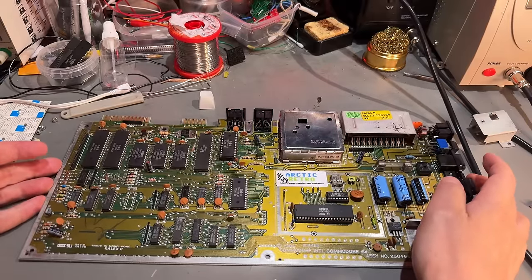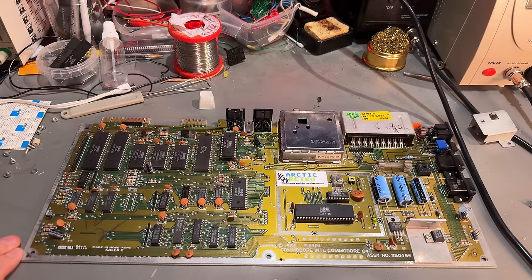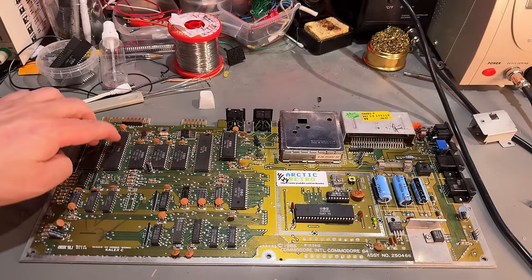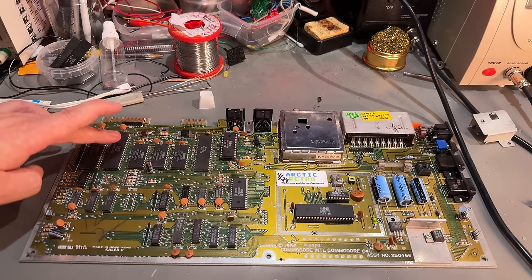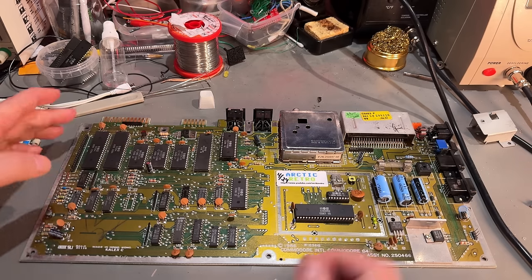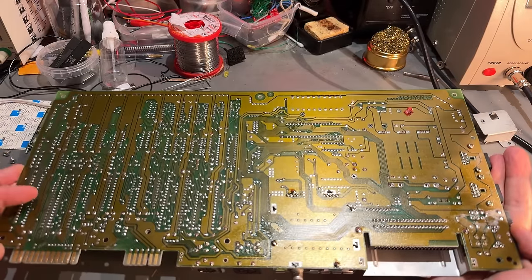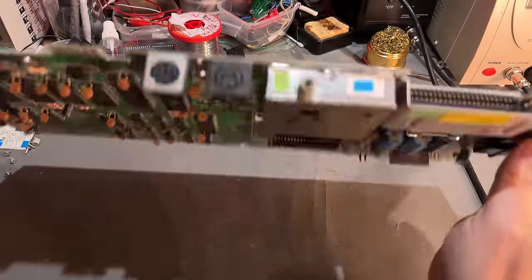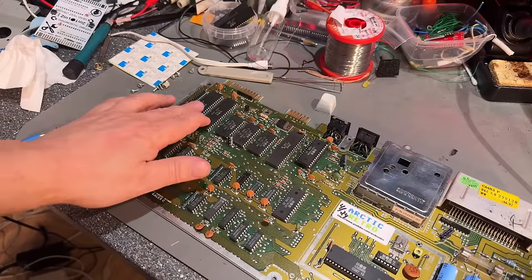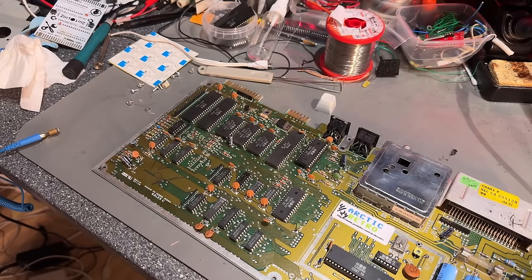And yeah, that could of course come from many things, but seems like the diagnostics test is correct and it indicated both the CIA chips. I mean, at least one of them is partially working because the keyboard is working, but it could be partially faulty. I'm gonna check and see if there's anything that looks wrong physically. If not, I'm gonna desolder the chips and place them into sockets and try with some other chips.